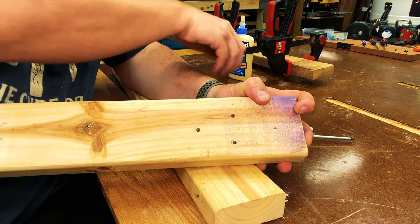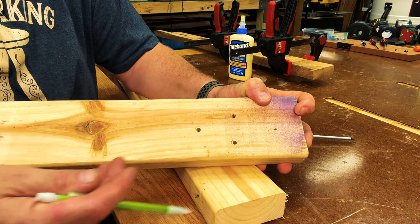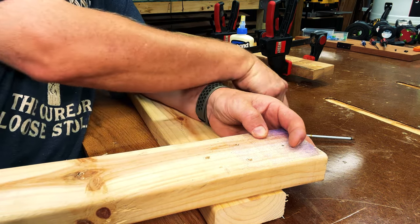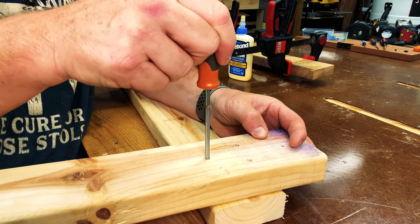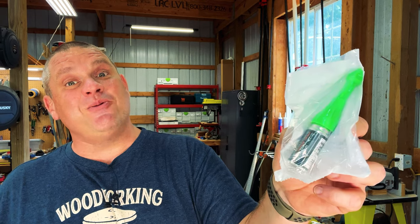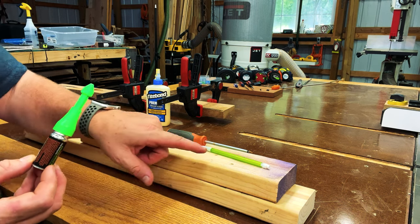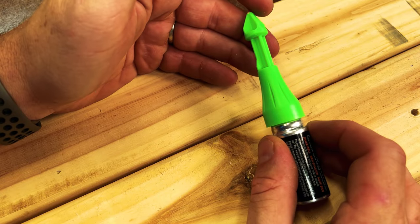So let's say you have a piece of wood where you have three holes drilled out that you want to attach to another piece of wood with some carriage bolts. In order to make sure that your holes are perfectly aligned, you may need to make some markings on that secondary piece of wood. If I place my piece of wood with the three holes on top of my other piece of wood, you can see that my holes are too small for my pencil to fit in to make any markings. Now I could use something like an awl, but your awl may not be long enough or it may be too thick to fit in those holes. So this next gadget is the Duramark Chalk Shot. Let's open up this bag and see how it works.